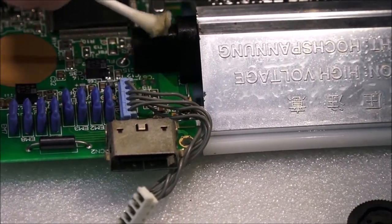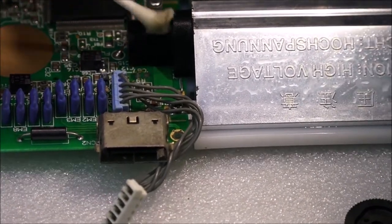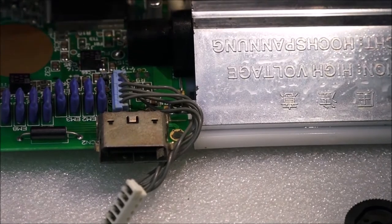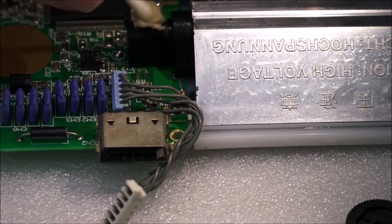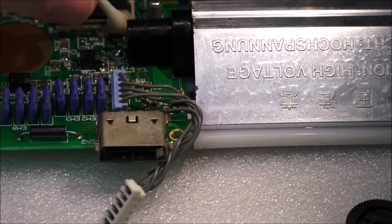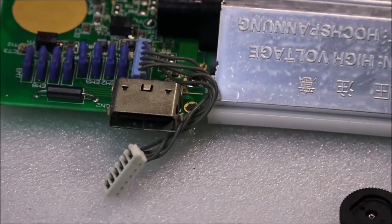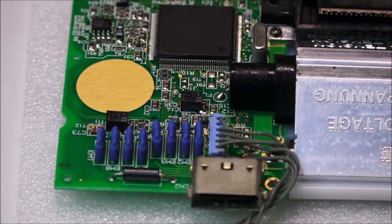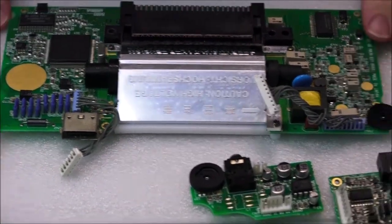So basically if you have a surface like this, it acts like a dirt magnet. Any dirt in the air will just get stuck to it over time, and of course that will build and grow out. And it's also a very large dirty surface for mold and such to grow. And then that will consume more moisture, and it will destroy all of the circuitry around the board. That will be about as fun as, it won't be great.